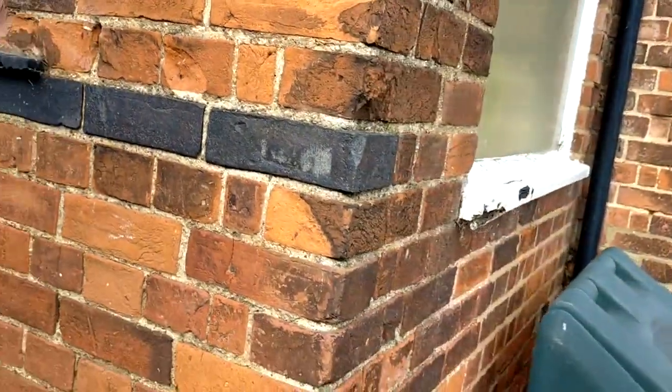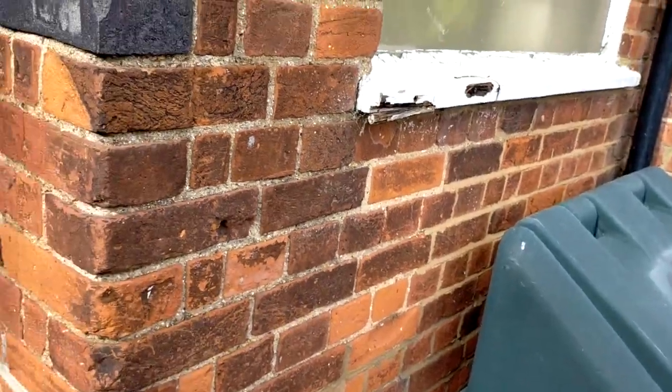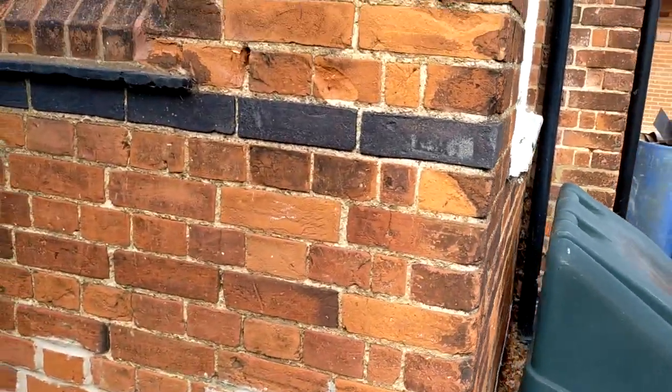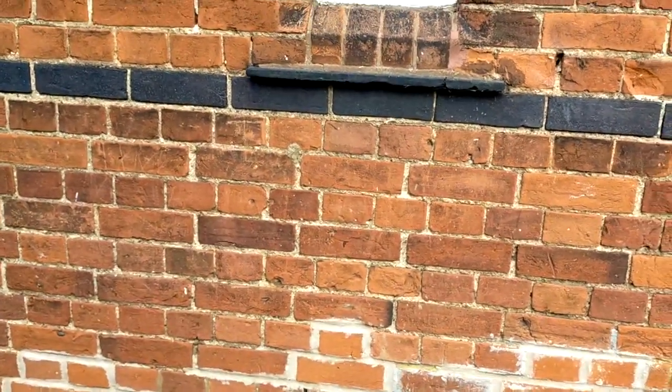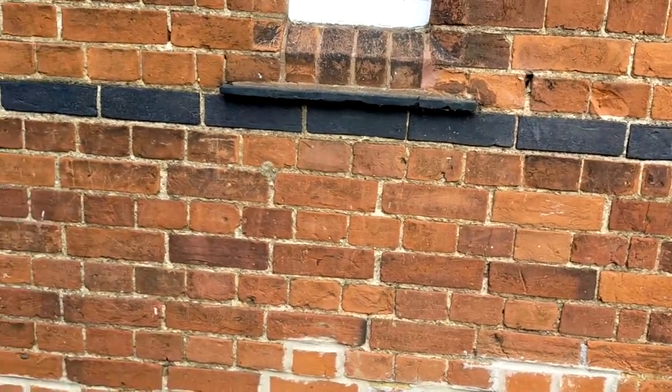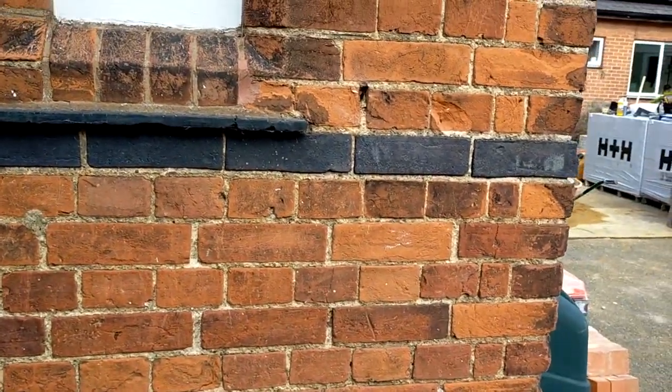Right, have stretchers going that way, headers going that way, header closure, no three quarters. You only do three quarters if you're instructed to, and if you're doing three quarters, it's all the way through the job. Not header closure here and a stretcher one side and that, it looks awful. And what you have to do, you have to break the bond sometimes.